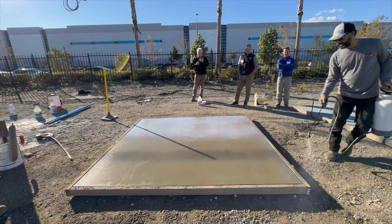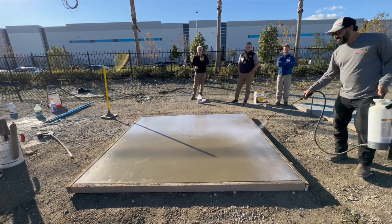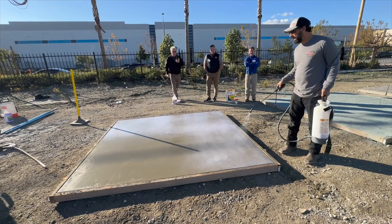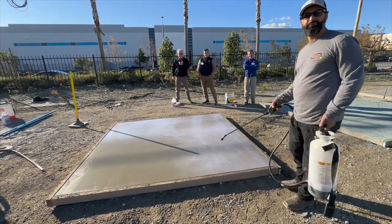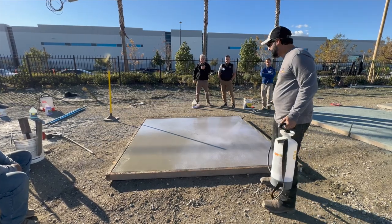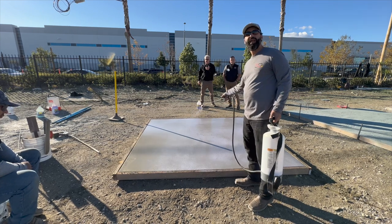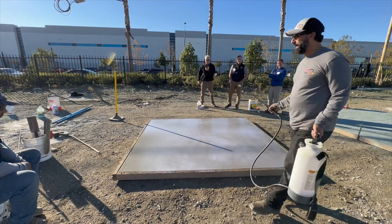Would you do that with a power washer or a garden hose? Great question. I'm not a huge fan of a power washer for several reasons - a guy can tear up a job pretty bad and you can have streaking from north to south or whatever. So if you're doing same day removal, it's as easy as coming in with a hose and a broom and just rinsing it off. Then I'll come back the next day and power wash it - just a final rinse.